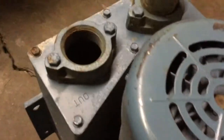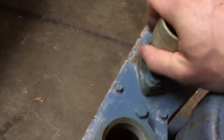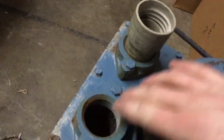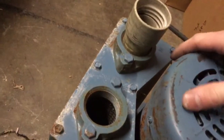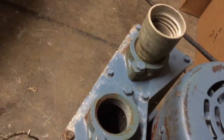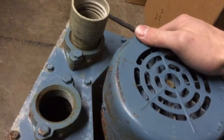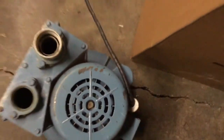Now that it's back in place, I'm going to tilt this on its end — it is still pretty heavy being an induction motor. This can either sit on the floor, get bolted to the floor, or bolted to the wall. I've got a hose cuff on the intake side connected to a separator; this is the exhaust. Both ports are inch-and-a-half NPT. If this were part of a system, you'd want metal tubing off the exhaust and plastic is fine for the intake. This unit is slightly smaller than you'd generally want for an industrial vacuum system — those usually start at five horsepower for a single operator, and seven-and-a-half horsepower can give you two operators.